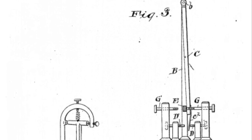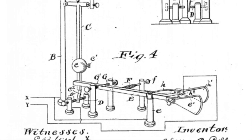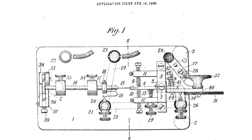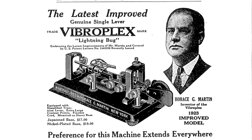And yes, this is a very complex story — because Coffey's patents were full of very crude and ambiguous drawings, this court ruling didn't preclude either company from continuing to market their products. Horace Martin came up with yet another improvement on his 1904 patent, which he then sold under the name Vibroplex. Both Coffey and Martin's original designs worked on the so-called release principle, where the pendulum was pre-tensioned using a mainspring and only released by the movement of the telegraph key. However, in Martin's 1905 redesign — the Vibroplex — the telegraph key and pendulum were connected together by the mainspring, and the pendulum was set into motion directly by the motion of the key. This turned out to be a lot more effective, and the Vibroplex outsold the Mechograph keys by a wide margin.